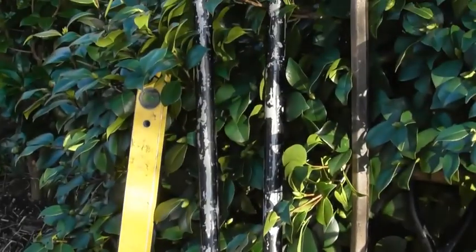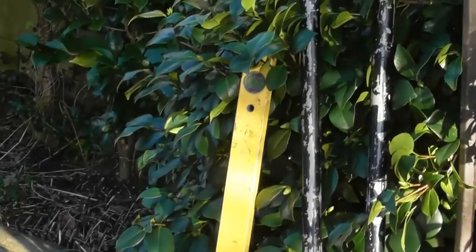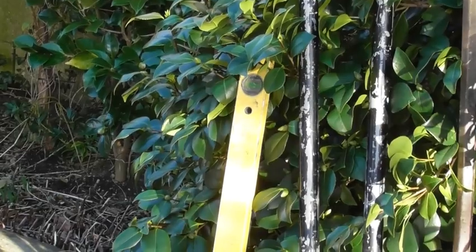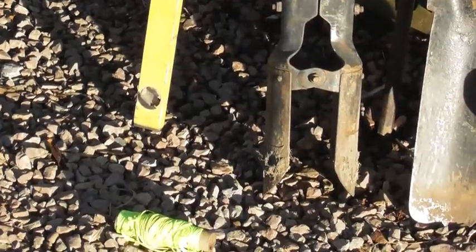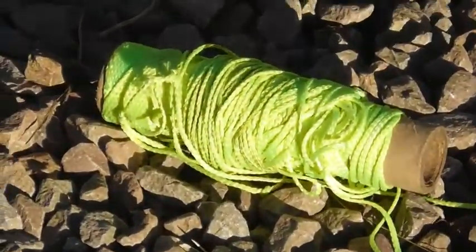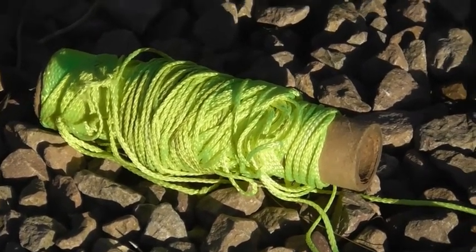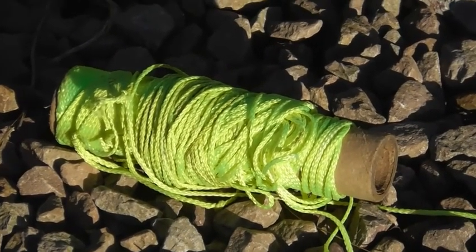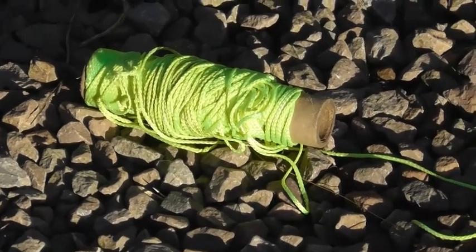and it pulls the soil out without ruining your back. And there's a spirit level, which is useful if you're using feather edge boarding, you want to get them vertically upright, then that's ideal for that. And then also there is a roll of strong luminous string, which is the line for making sure you get all your fence posts in the correct alignment.